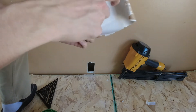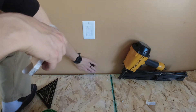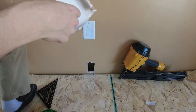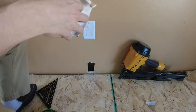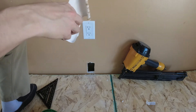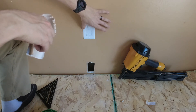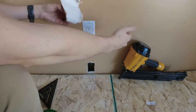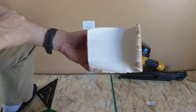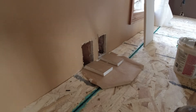It's a really good way to patch your drywall and actually have a solid piece, versus just laying some vinyl tape or mesh over the hole and mudding it up. With this method there's actually something there versus just a hole, so in the future if someone's trying to hang something or attach to the drywall there's not just a cavity — especially if you're doing a bigger patch that's not quite big enough to go stud to stud. I used this in the basement patching a hole for a three-switch box and it works out fine. You can hardly tell there's a patch there.